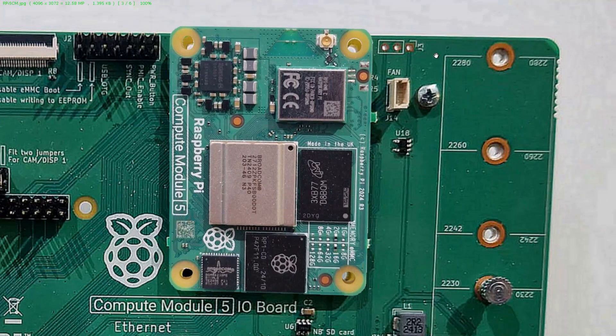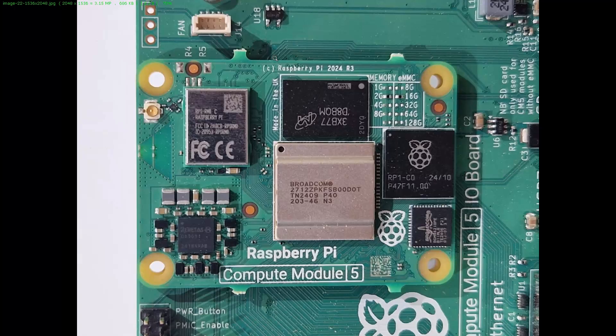I don't know exactly what these pins are used for. I know that Raspberry Pi 5 has a video output, so possibly this is a video output. But the lines here are very close, so you cannot be sure whether this might be power. I know that the middle two pins — one tells PWM modulation, which sets how fast the fan should turn; one is the 5V power supply; and the other measures the RPM. The fourth one is ground. Here we have just three pins, and this one seems to be ground. It's hard to say what this could be used for, but it's obvious that you can solder a three-pin header if you need it.